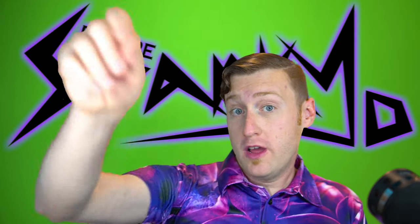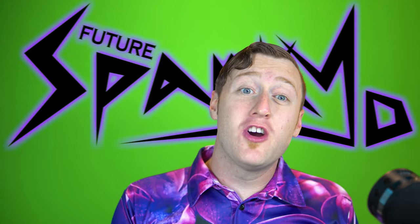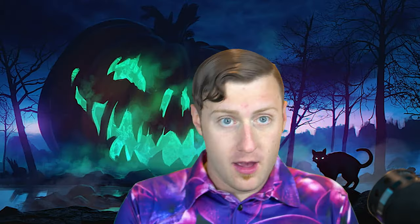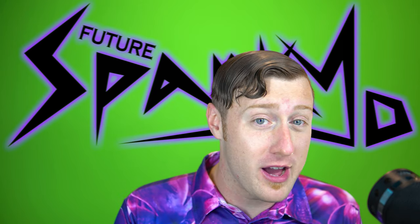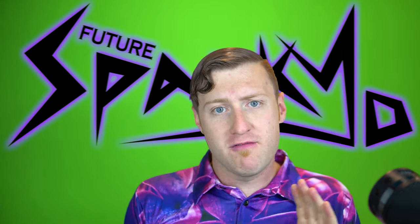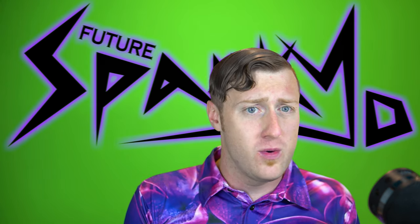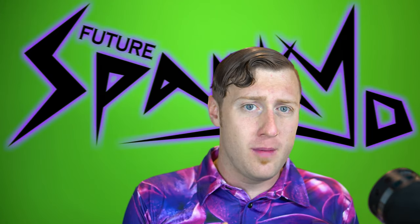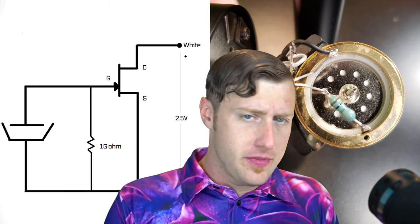Hello from the future — now I'm older, wiser, more attractive, as you can probably tell by my new shirt. It is now mid-October. This is supposed to be an easy tutorial to show off how swapping capsules in your microphone can make it sound different. I've been doing a lot of research and experimentation, learned a lot about condenser microphones, and I believe I now know enough to explain the basic idea behind what went wrong. The short version is that I used the wrong part, but I was able to make it a lot better by adding a JFET. If I had done this capsule swap on a more traditional XLR mic, I think it would've worked.